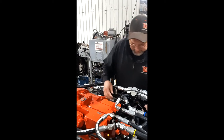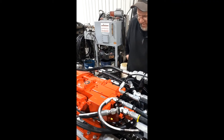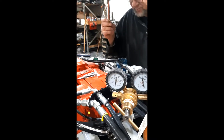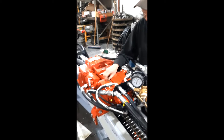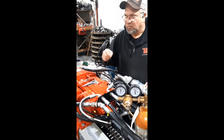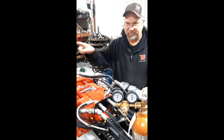When you go to charge the accumulators on a drifter like this, they hide them underneath all these hoses — that's what good engineers do. I'm taking the cap off of it right now. Keep these caps on — it's major important. If you get debris down in there and it gets into the accumulator, it'll get behind the diaphragm and a grain of sand can put a hole right through that diaphragm.